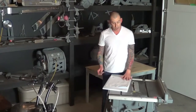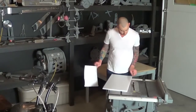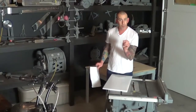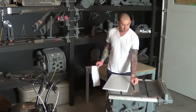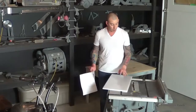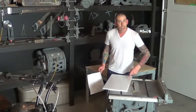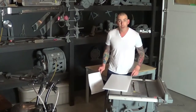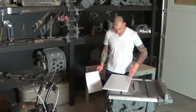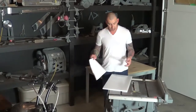What I've got to do here is take this plastic piece and cut one strip off the edge, because I need a long blade's-width thickness piece of plastic to go along here. I'm going to run a dado into this edge and this edge to accept a thin piece of this plastic the same size as the blade's width, to have the square glide along. Let's get started.